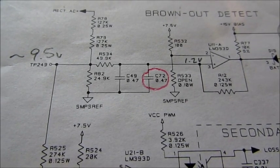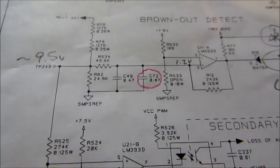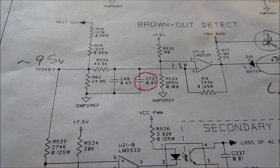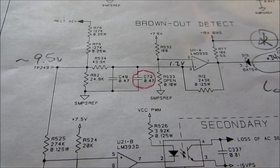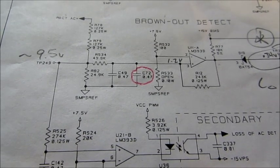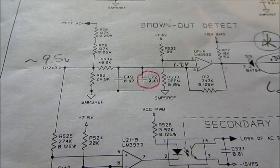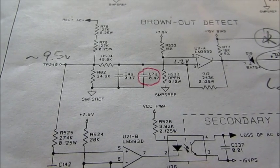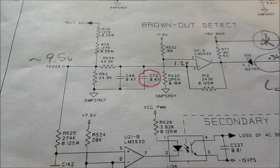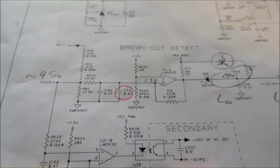So a little bit of a piece of information about these capacitors. They're ceramic 1210 style. They're 50 volts. And typically ceramics don't go bad. They're pretty robust, but what generally does kill ceramics, and probably was the case with this, is when the board is put together, if the ceramic capacitors see too high of a temperature, you can wind up with problems over time, especially when heat is involved. So I replaced both of those two capacitors in the comparator, and now, as you can see, the results are